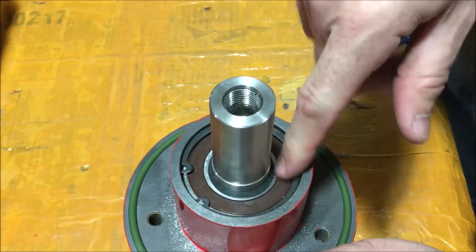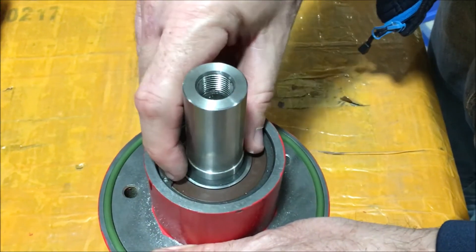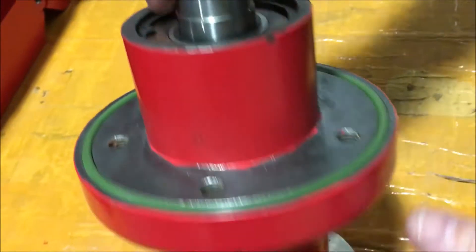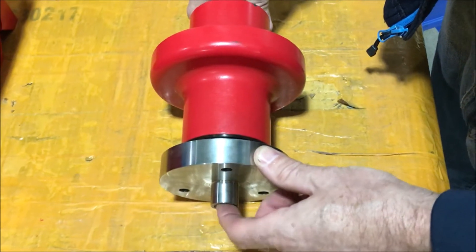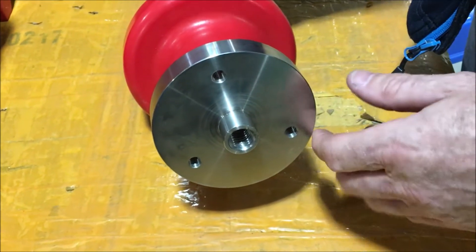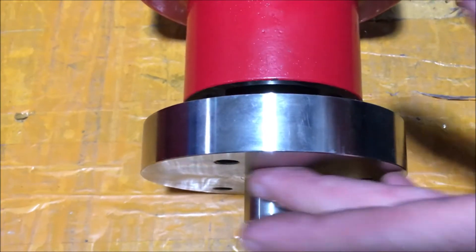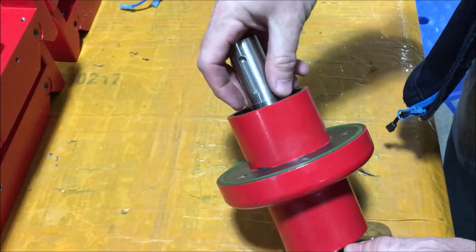I set two precision ball bearings — one in the top, one in the bottom — and the bearings are held into the housing with a snap ring. Generally flat laps aren't super high speed, so a press fit isn't really necessary. Our arbor shaft is stainless steel 316, and all of our arbors are through-drilled, so you can run any of our laps with a water supply through the center as a standard feature. We've got a flange where we hook the main plate — we welded the flange to the arbor shaft, then faced it so we get a continuous seam with no runout.